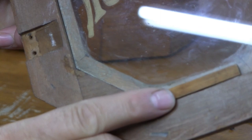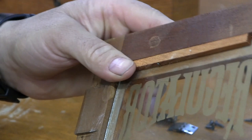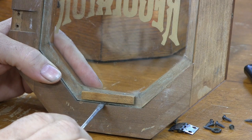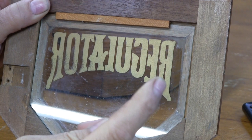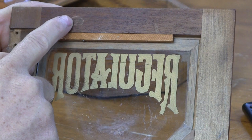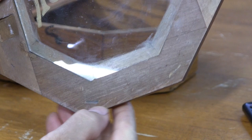The glass is just held on with these two little blocks, held on with brad nails — two brad nails. I'm going to remove those. And the eyelet on the side for the door catch — that was real loose in there. You can also see there's some old finish layered on top of this wood. Then you can see indentations of the staples here in the bottom — these mitered splines. There's a staple here, here, and here. When the door closed, it was rubbing up against them and made indentations. I might drive them down a little bit so they don't contact the wood.